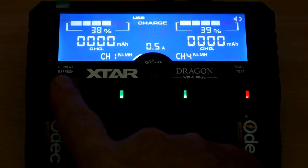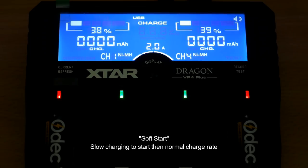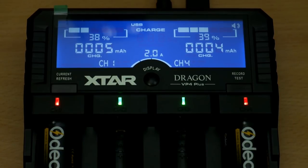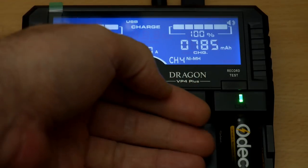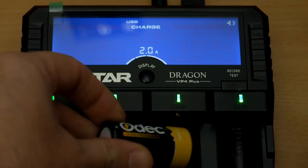So that may or may not be an issue — just remember that if you are doing a test the charger might be out of action for a while. The soft start slow charging: with cells set to 2 amps there's a delay of about 7 or 8 minutes and then it moves up to the top rate. The milliamp hours increase into the batteries quite quickly. I personally would have liked a voltage display, but the percentage display is quite accurate and gives a very good idea of charge condition. There are no heat issues even at rapid charge rates — the unit and cells get only slightly warm.